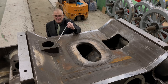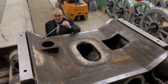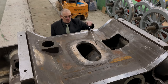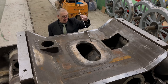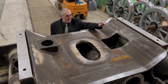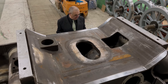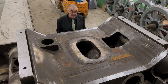This will eventually have a spherical lens joint on it and four studs to connect the pipe to. The hole in the middle here is for the blast pipe, and the blast pipe itself bolts onto the top of here once Howco have finished machining and adding stud holes. And finally we have a hole over here which will simply have a lid on it, bolted down. The purpose of this hole is to facilitate installing the drive to the inside cylinder steam valves.